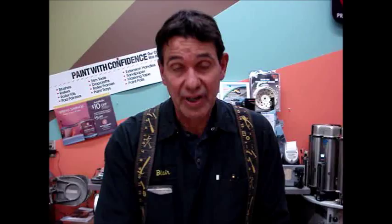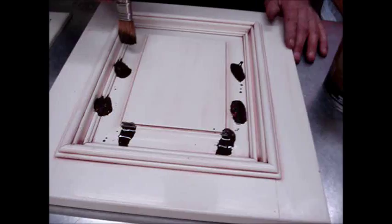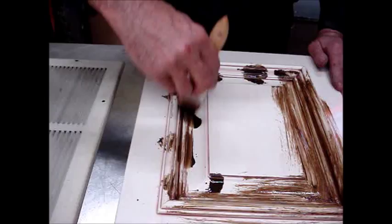We're going to show the pattern of how you're going to put grain on a piece of wood and make it look like it's wet. The neat thing with most of the wiping stains is you have a long time to work with. You get it on in as consistent a pattern as you can first — not too thick. We're not painting; we are going to be antiquing.